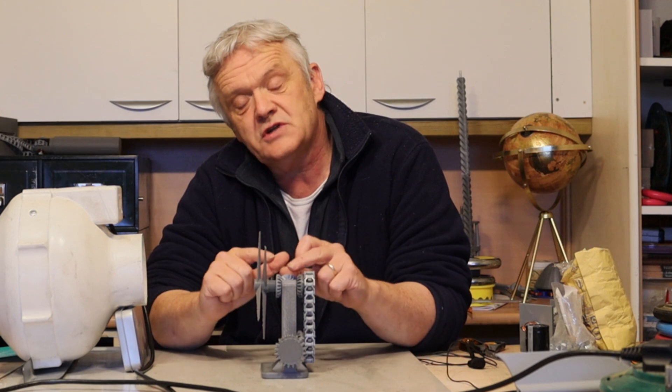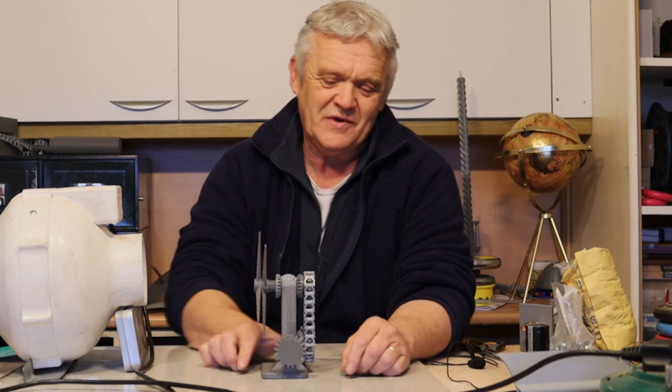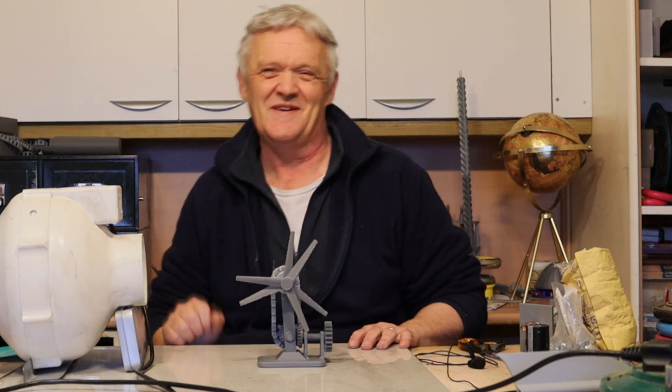It's all very slack and it needs to be, to make sure it'll turn when made out of plastic parts. A redesign would be to put bearings in here — if you put bearings in, it's going to operate much more smoothly. Without bearings you will still get a result from this model, as we've seen it will turn, and as long as you do testing under the same conditions the results are valid. I thought I'd share that with you because I think it's quite an interesting idea on the contra-rotation. I hope you enjoyed the video — thank you very much for watching, and please do remember to like and subscribe.